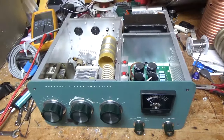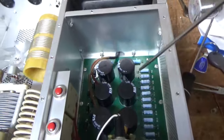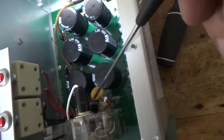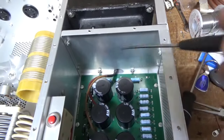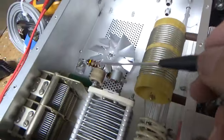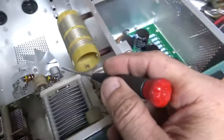Okay, I'm back with the completed Heathkit SB200. I'll go over everything I did real quick. New Harbach filter cap board assembly. New meter lamp bulb. Reverse-connected diodes across the meter movement. Heat shrink over the plate secondary leads where they come through the wall for added protection. New plate blocking cap. Cleaned the rotary switches with Deoxit Gold. Compressed the anode clamp connectors.